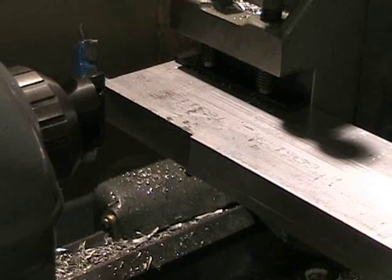I couldn't get the angle correct after I'd cut one side of the dovetail, so I stuck a vise in the milling attachment and tilted the whole thing back — necessity is the mother of invention. Now we have a dovetail bar with two sides beveled 15 degrees from the vertical and we have the two radius cuts. We just need to flush this part down a little bit and drill the holes for the mounting screws. Once that's done we can cut these end pieces off and file the whole thing down and make it pretty.